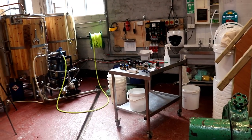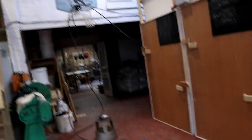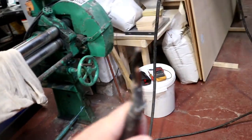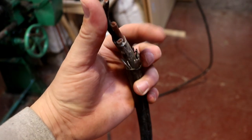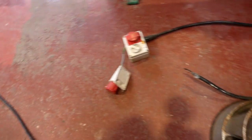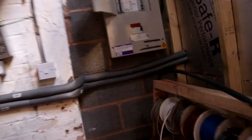Going upstairs into the back room has allowed me to solve the problem a little bit. We've got two 4mm square flexes of varying lengths - one about three meters and one about five meters. I've also been in the back room and I had a roll of armoured cable, three core - look at that. So that should do the job to pull the power over from the distribution board to this side, meaning we don't have to tap off of this. All I need is a rotary switch for single phase, an outlet, and then to hook up the other end of this three core into one of these sockets up here.